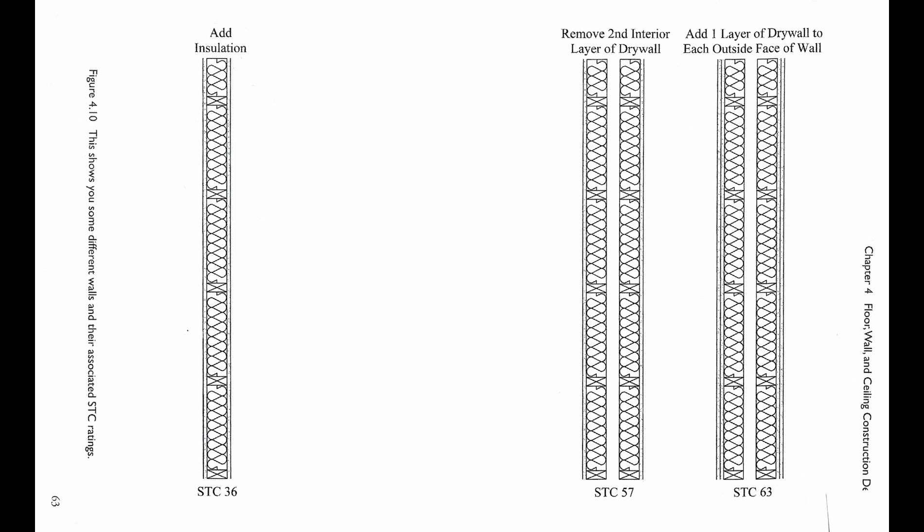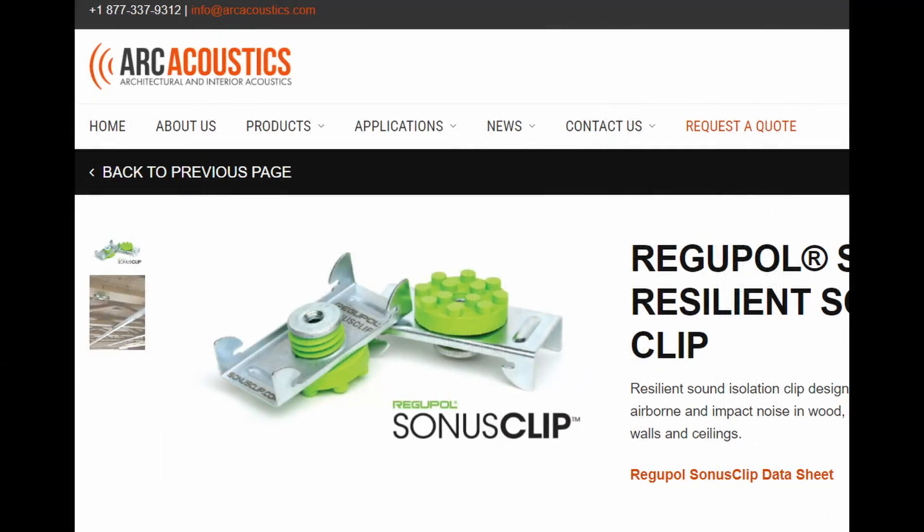That's especially true in a shared building like a home where sounds can travel through the structure into different rooms. You need to fully isolate your studio from the rest of the structure to get meaningful levels of sound isolation. I'm currently on vacation and will be rebuilding the ceiling using Sonus clips — essentially the same as the DE90 clips I used for the walls, but made for use with furring channels. Hit subscribe to be notified when that video comes out. I'll do before and after recordings so you can hear the difference isolation makes.